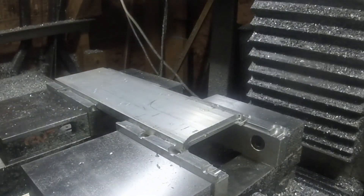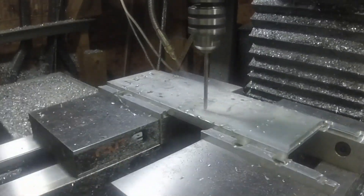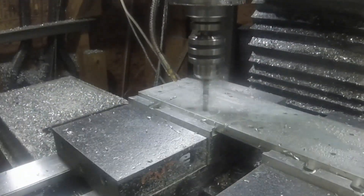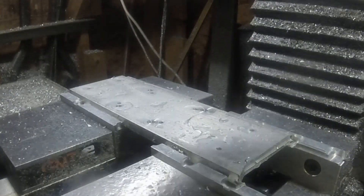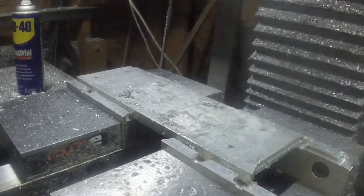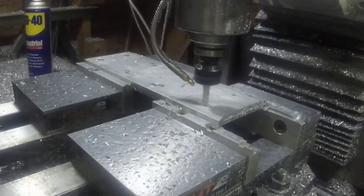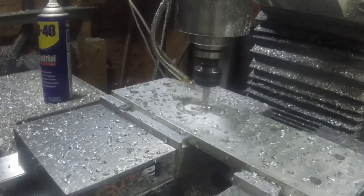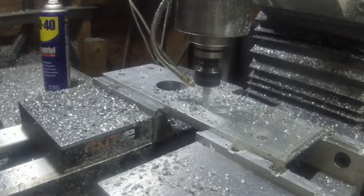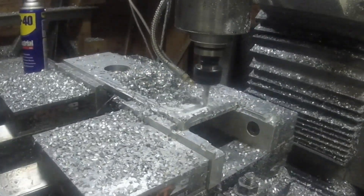So here's the piece of stock in the mill. I had a bit of a challenge — the four center bolt holes on the manifold itself were extremely close to the four stud holes for the carburetor, so I couldn't use the correct size bolts because the head was just too big. It wouldn't fit. So I found some threaded inserts, which are threaded on the outside and the inside. They fit down into the holes in the manifold, but they've also got internal threads so you can bolt smaller bolts into it. That's what we had to do.